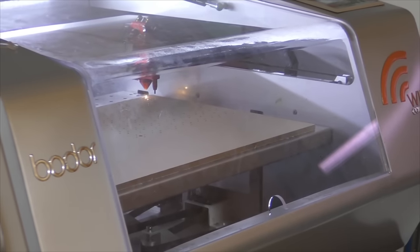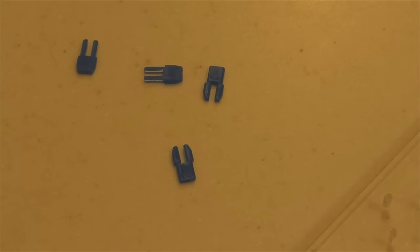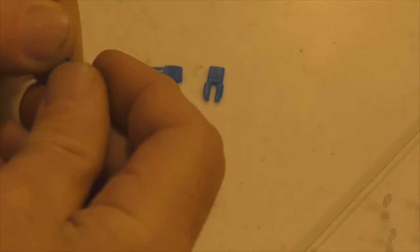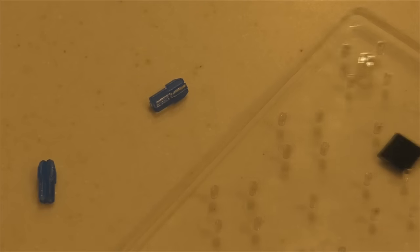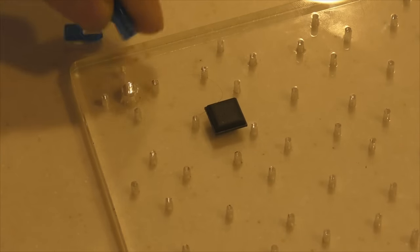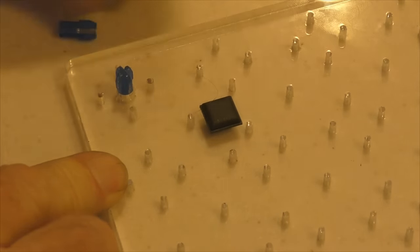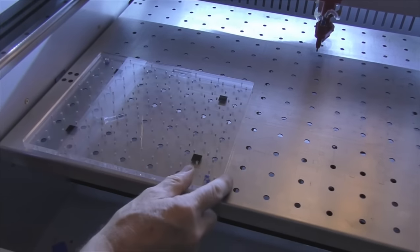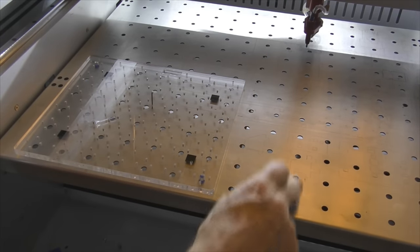So we're making a pin table and he's anticipating supplying all sorts of goodies with this machine. We've just made these little pieces which are out of 1.8 or 2 millimetre acrylic and they just plug together like that. We then bring our pin table into view and that is going to be a nice snug fit in that hole there. We've arranged these pinholes so that they miss the holes in the table.